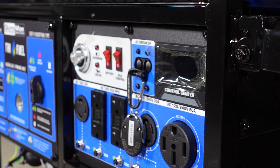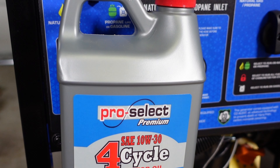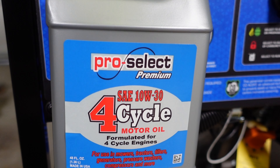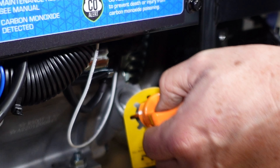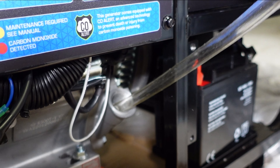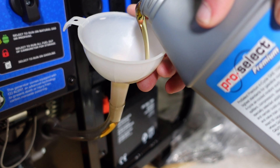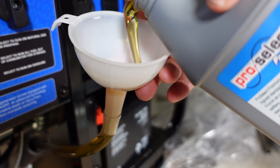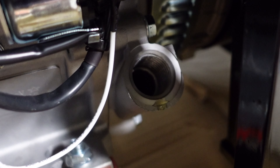Generators require oil so let's add some oil to our new generator. The owner's manual suggests you put in 10w30 oil, so we picked up enough to get the job done. Simply remove the oil cap shown here, place the tube from the included funnel into the hole, and fill it up. You will know when it's full when the oil reaches the lower lip of the opening. Once you've verified the oil is at its proper level, replace the oil cap to the generator.